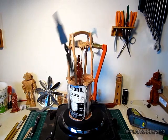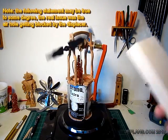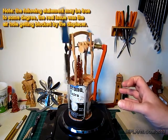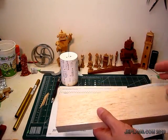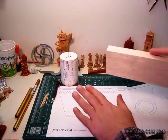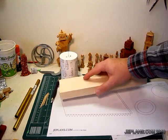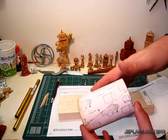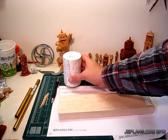I believe I can extend the operational range of the engine by making a solid airtight displacer. I'm going to do that out of balsa wood - still lightweight, though counterweights will still have to be slightly bigger. That should improve the engine by having less air volume within the chamber to absorb the pressure or vacuum when trying to drive the piston. This is the balsa I'm going to use. I'll still use the actual displacer plan from the displacer plan generator, and basically make three discs inside the interior of the displacer - one on each end and one in the middle. I'll still wrap the cylinder with cotton paper to give it solid structure.